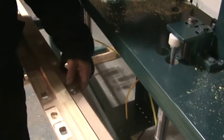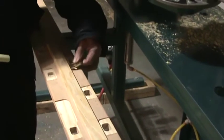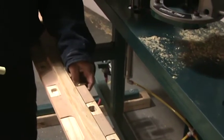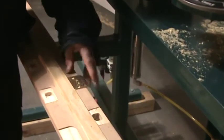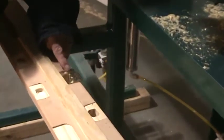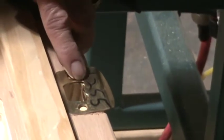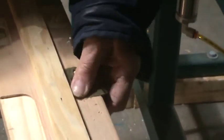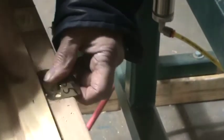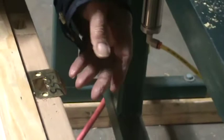The plate fits in there real nice, and you can see it's nice and flush. It'll do a nice pocket. We actually make it just a tiny bit bigger, as you'll notice that some of your strike plates are a little bit oversized. We use one here that is 255 thousandths, which should be 2 1/4, but it seems sometimes that the manufacturers get them a little bit off, so we make the pocket just a skosh bigger so that it doesn't really rattle in there, though it won't with a 250 either.